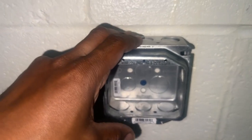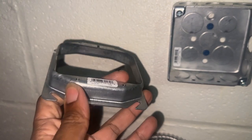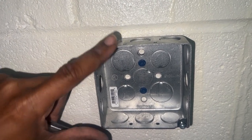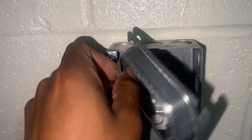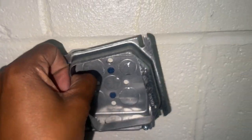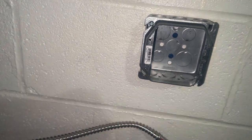We got some metal boxes right here — a four-inch metal box. We went ahead and got this adapter to screw the plugs to, because if not, you'd just have these two screws for a blank cover. But if you want to use this box for actual outlets, then grab this cover right here. Put that on, screw that down, and then we'll be able to put our plugs on there.